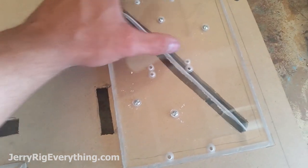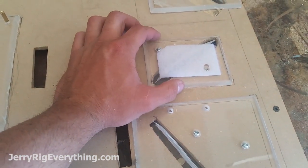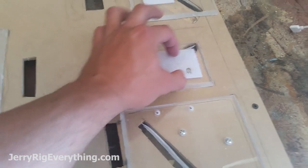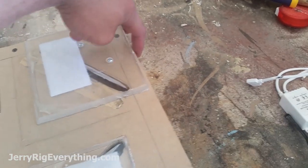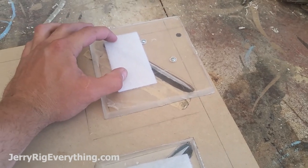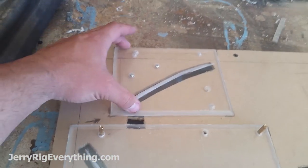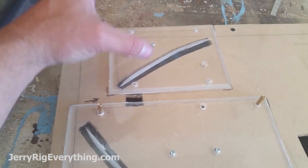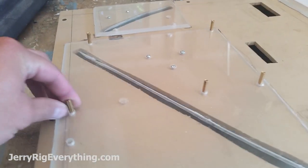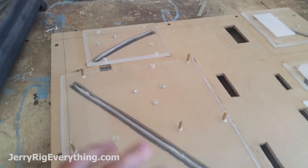For the hard drives, four screws come up into the pre-mounted holes that come with the hard drives. For the SSD, there was no really good way to hold that on, so I just used some industrial velcro which is good for 20 pounds — the SSD weighs probably about a third of a pound. For the power supply, I have some pretty hefty brackets on the back that screw into it, and a piece of velcro helps hold it so it doesn't twist downward. For the fan, screws keep it elevated so there's enough circulation underneath for it to blow out, and I can always change the elevation. For the motherboard, I have one inch standoffs lifting it up and away from the plexiglass, with screws holding the plexiglass down into the board, plus three screws coming from the motherboard underneath the wood.